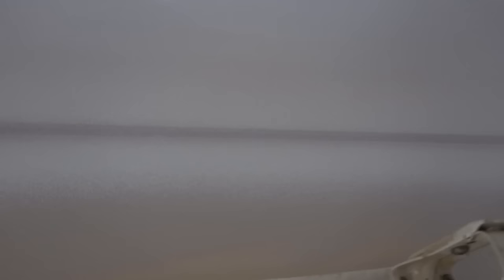Have a look at the finish on this and the full control. Now I've got all the cornices or coving done in this room here. Perfect finish, and have a look at the control. Over on top of the windowsill here, I just basically lift up the fan just a little bit higher and I've got perfect. Have a look at the overspray, almost zero.